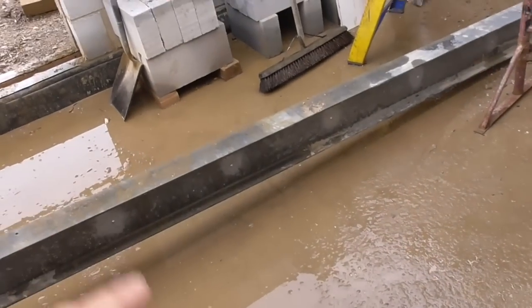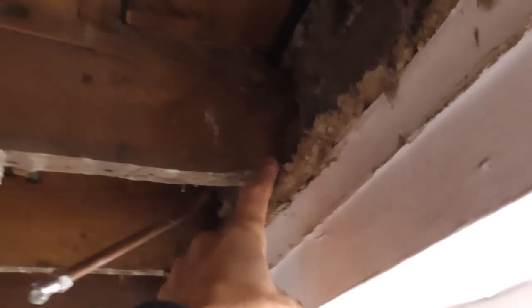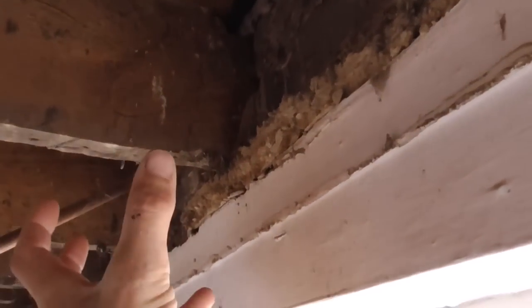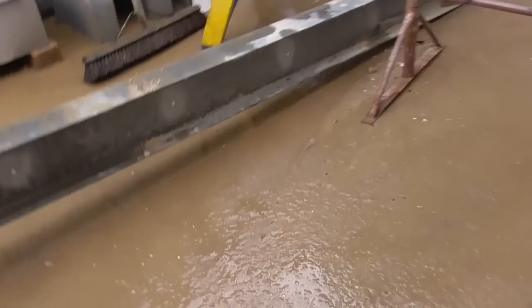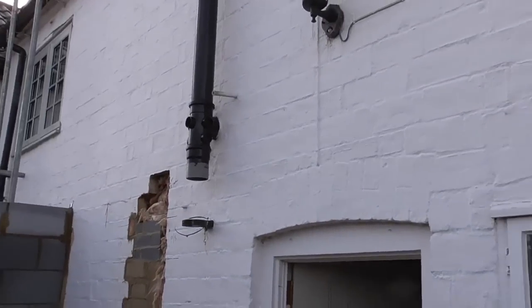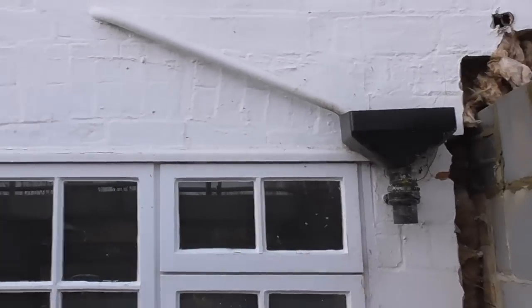What I'll have to do — if you look at my steel down here — once the timber's inside there, we can find a line. We can cut some of these joists off and get new joist hangers onto that timber and that steel, which will catch all those. So I'm going to jump back out of here and try to set a camera up and watch how our progress goes.